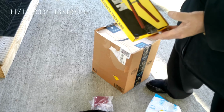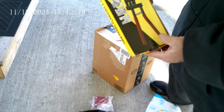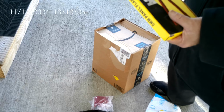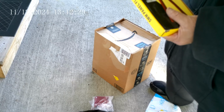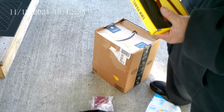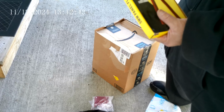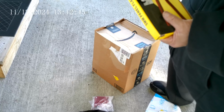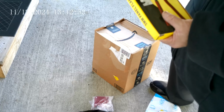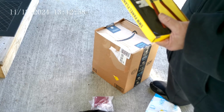This is a 5mm panel flanging and punch tool. Now what this means is a panel tool. You go to the edge and you use this to make a flange. That's a part that's kind of curved up, an edge, and you make the flange, which is 5 millimeters, so it's nice and consistent. Imagine having a tiny metal brake. That's what this is. You make the flange, and then you turn the head around, and you punch the holes, and it'll punch holes 1 millimeter thickness.